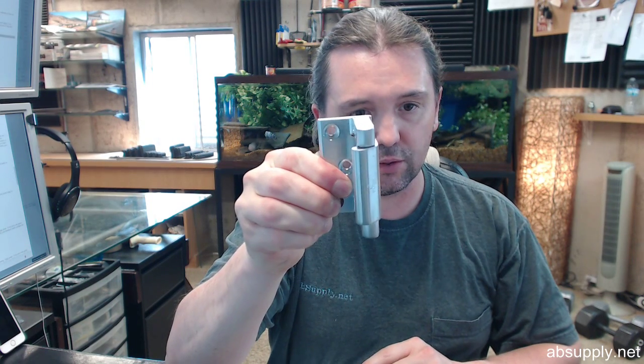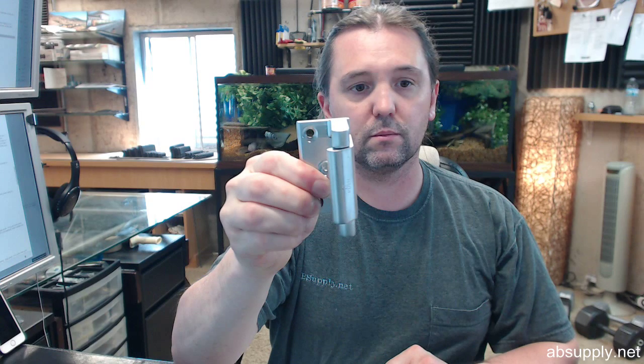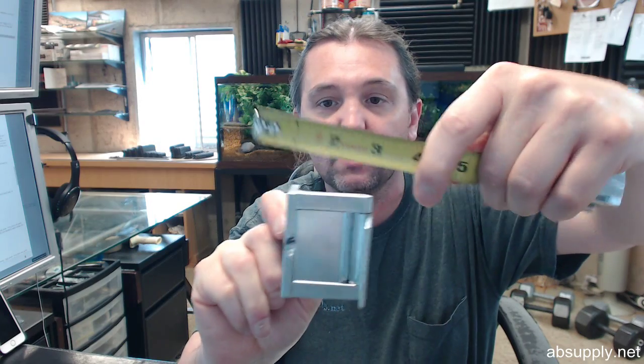This is what you are going to see from the inside, and when you lock it at night, this is what you will see. So the question is how far will the door open? Not knowing the exact amount of inset that the door has, it is going to be less than an eighth of an inch. From the face of the frame to the end of the privacy bar is about two inches. So realistically, if your door is inset just less than an eighth, this is going to open up the thickness of the door assuming it is inch and three quarter. You won't really see much through that amount of available space, but it is intended there to allow communication.